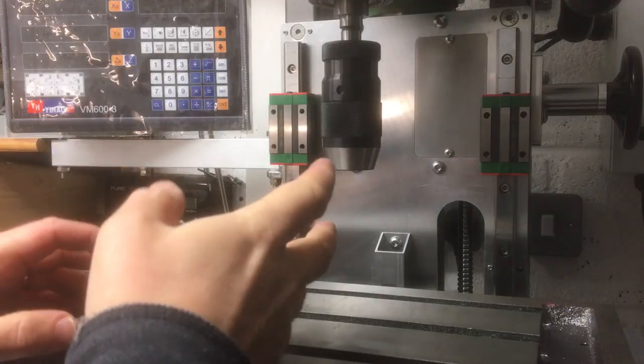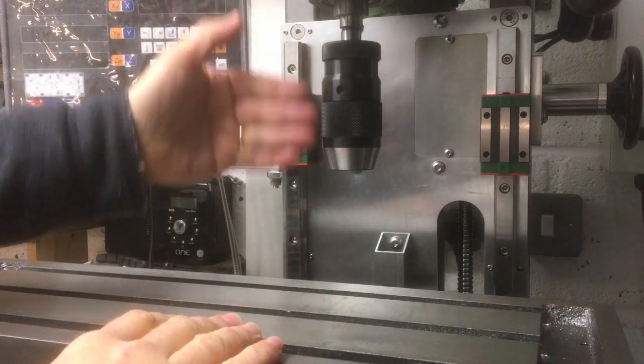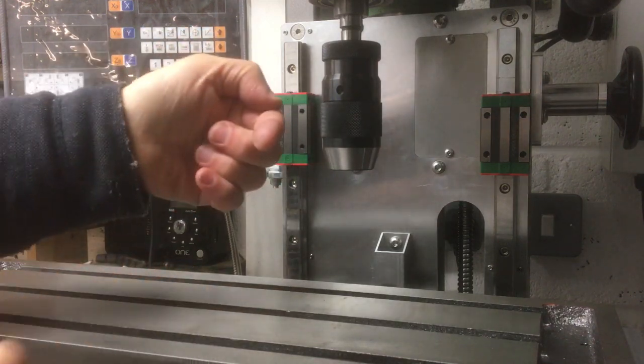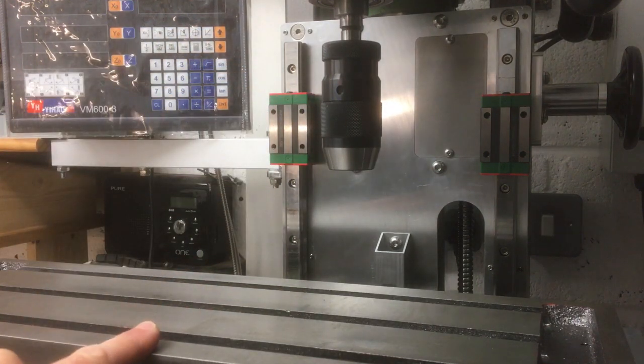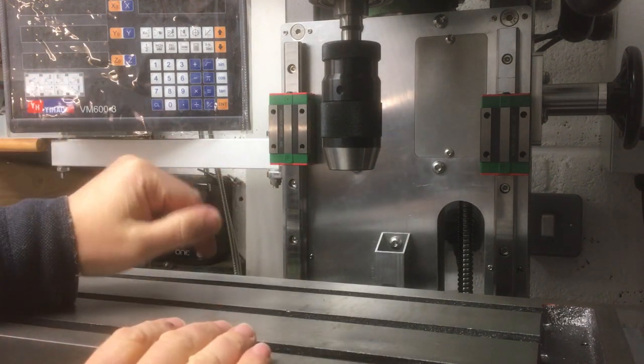Nice. So you probably noticed that the display was going the wrong way there when the table was moving. Because we've got the chuck here, when the table's going that way, the chuck is effectively moving this way or towards the bottom corner, and 0 is down here. So we want this to be 0 or moving negative, and that way to be positive.